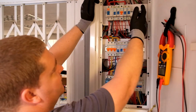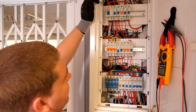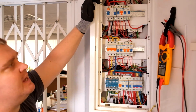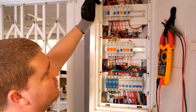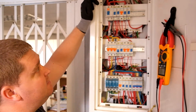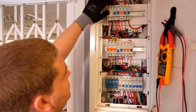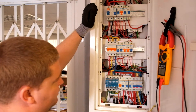And then here we've got a 40-amp with a nice thick wire coming out — probably around a 45–50 amp piece of wire from the 40-amp, which will be feeding another sub-DB somewhere else. We've also got a D-curve breaker. So yeah, this is basically the distribution points.